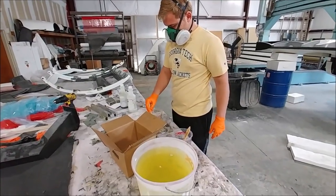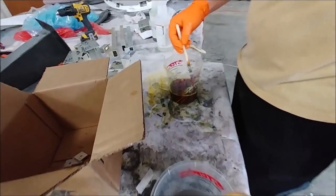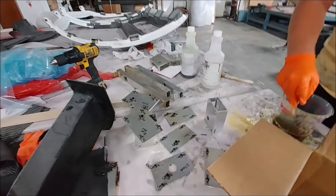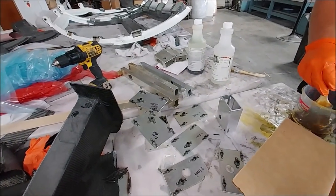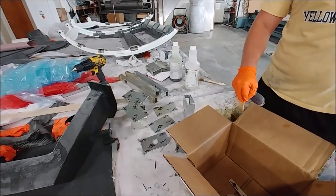Welcome back. All kinds of different things happening in the shop for the second half of this week. Here's Keith actually using some zinc chromate on some of the aluminum parts that make up the backing plates and also the main boxes for the door hook locks. Getting those prepped because we're not actually going to paint those — just going to put them in as they are with the chromate finish.